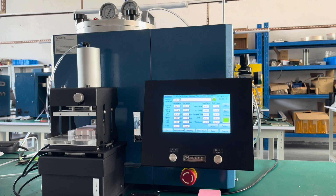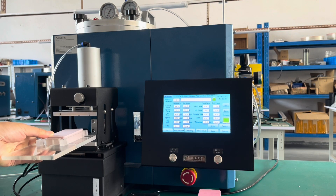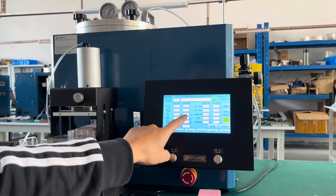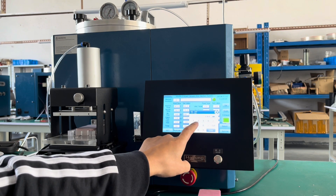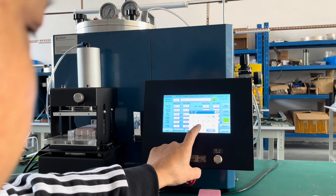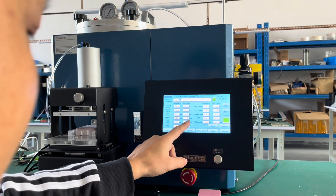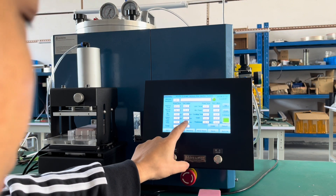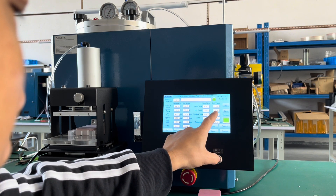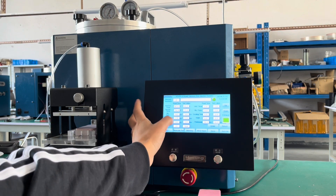Now we would like to show you manual injection. This is the rubber mold. We have already set the injection pressure to 100 or 105, clamp pressure to 110, and forward pressure is also set. Backing done. Save. This is the group 2 parameters.